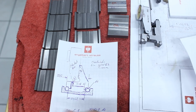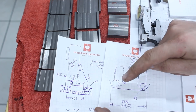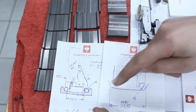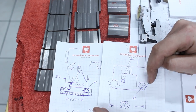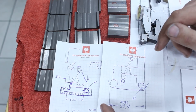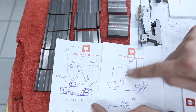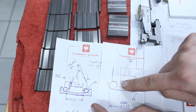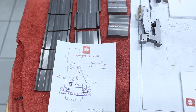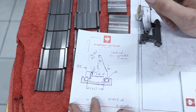It used a dial test indicator and a flexure and it was just a nice design. So I did some CAD work, sketched out my two-pin dimensions — these came out of a real CAD system, not my comic-assist drawing here. The stem of the dial test indicator reaches down close to the pin, measuring behind the pin. That was my first concept, then I made an actual drawing to build the thing.